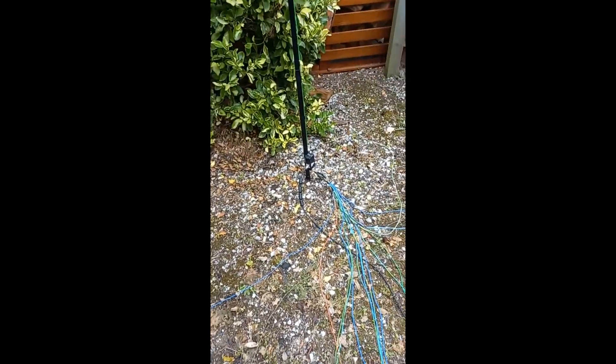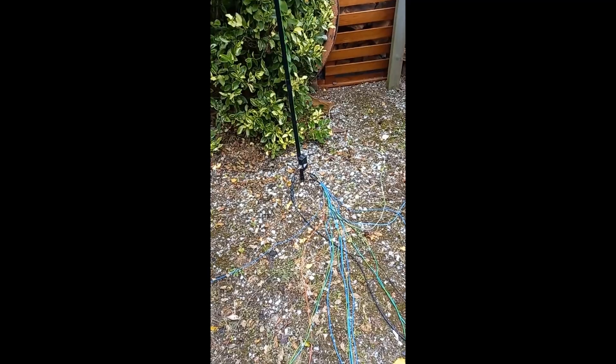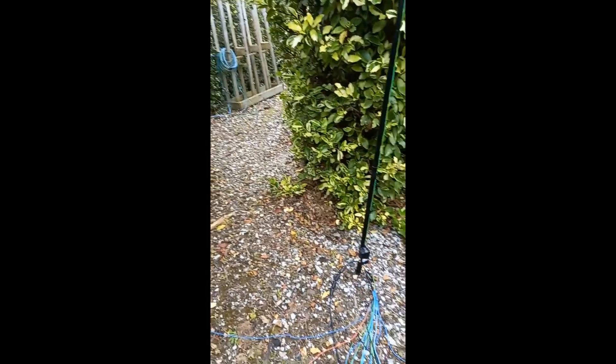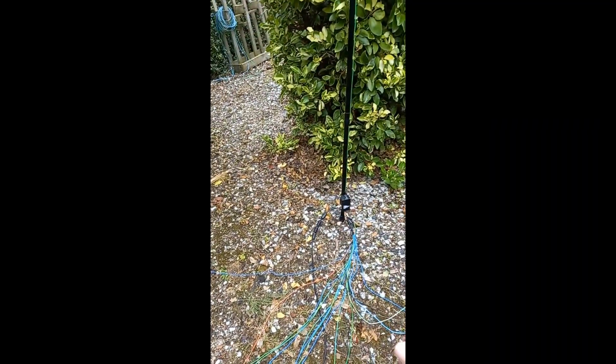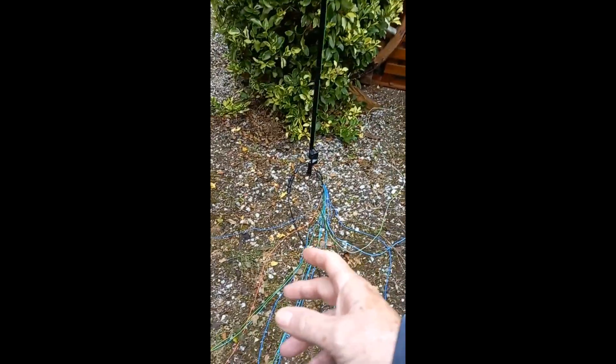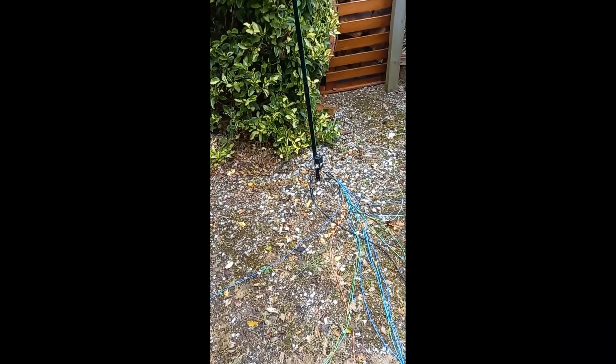So that's what we're going to be trying anyway. I just need to get the coax back to the house and spread the radials out. We've got maybe another 4 hours before the grey line comes, so we've got plenty of time to do the test. I've got the other 32 two-and-a-half metre radials all ready to go - just a matter of coming out here, unclipping the ones here, moving them out of the way, bringing the other ones in, and setting them out and retesting. I'm trying to retest within about 10 minutes, because obviously the propagation could change and that might change the results.